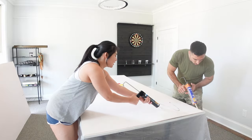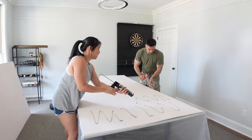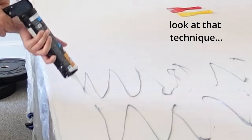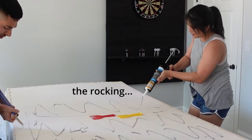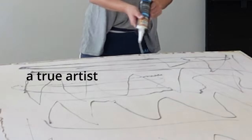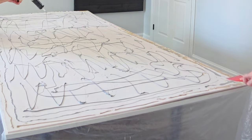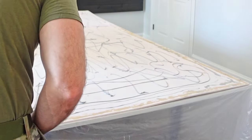After sanding to get a nice smooth finish on the boards, I took them back inside and with the help of my wife we glued the two boards together. I'm choosing to glue the two quarter-inch boards together because I ultimately want a half-inch thick backer board for the board games. That will make a nice heavy-duty feel to these frames. I could have bought a half-inch sheet of plywood, but since I had these quarter-inch boards laying around this seemed like the ideal way to go.